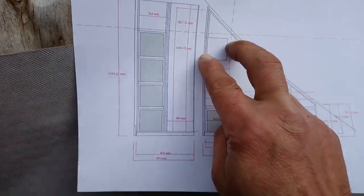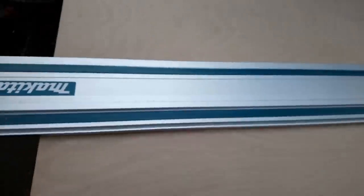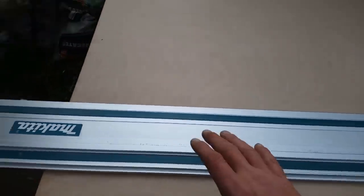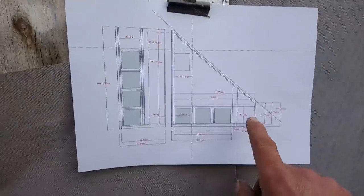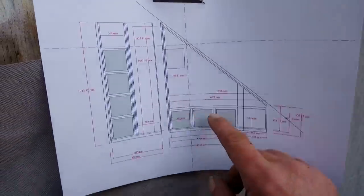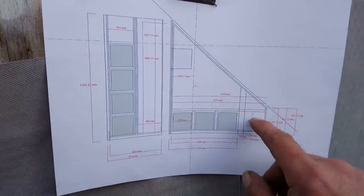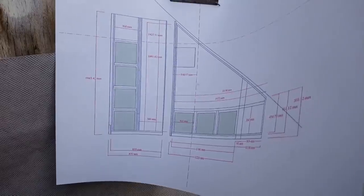It's 70mm - I've got two pieces to cut for the sides of this unit. Those ones are 398 so I've just made them 400mm, working up to my pencil lines. For the next ones I've got four to cut - I might be able to get these pieces out of the offcuts. I'll use my stop so I get a more consistent cut.